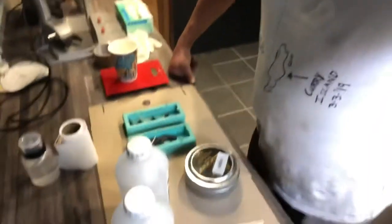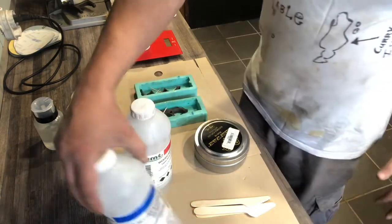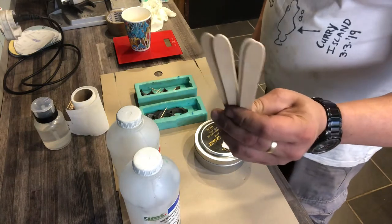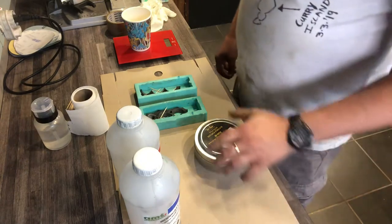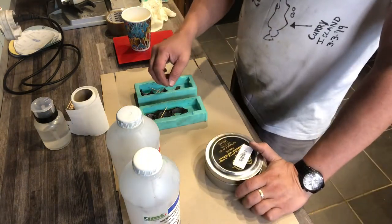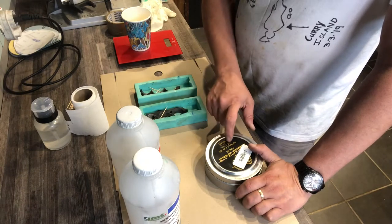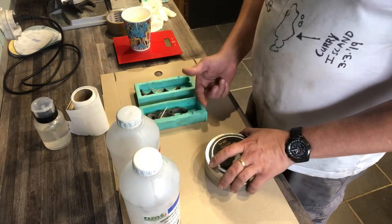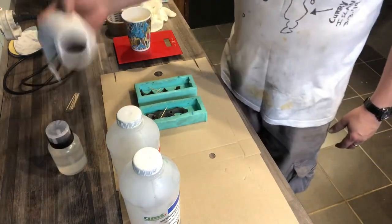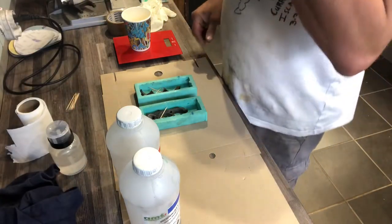What you'll need: I use this product — it's called Wood Cast 30, get it from AMT Composites. You'll need some wooden little goodies to mix the resin with. The releasing agent is basically polish. In this specific case I'm not going to use it — if I use a little weight to weigh down the scale because they float in the resin, I just rub the little weight with the releasing agent because that needs to release, but the resin releases from the silicone mold no problem. You also need some acetone to wipe stuff off, toilet paper, a cloth for wiping things down, and a little scale and something to mix your resin.